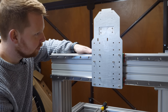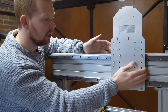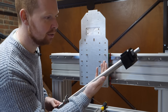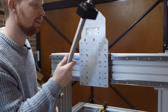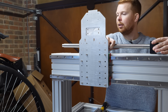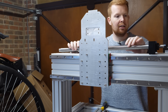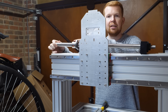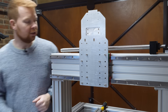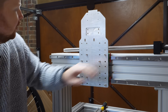The next step is to get the lead screw mounted on top, which will drive this axis back and forth. The lead screw is absolutely huge — 25 millimeters in diameter — which I think is way overkill, but it should mean the machine is just super rigid. I'm going to mount that on top and it will drive a nut back and forth to move the axis. I just need to get the bearings and cut some mounting plates to attach these to the extrusions.